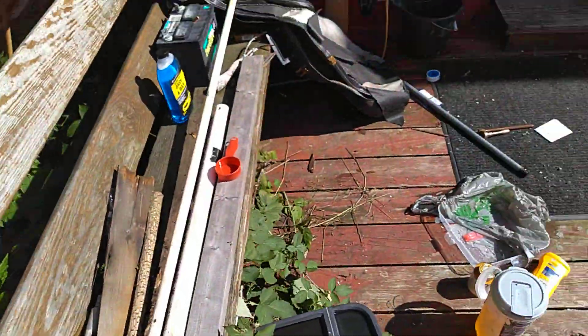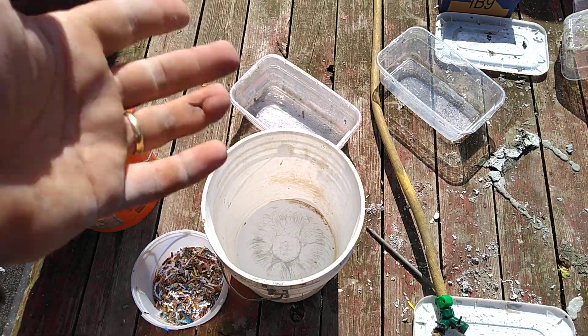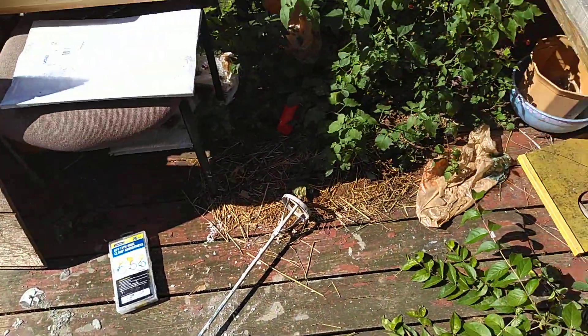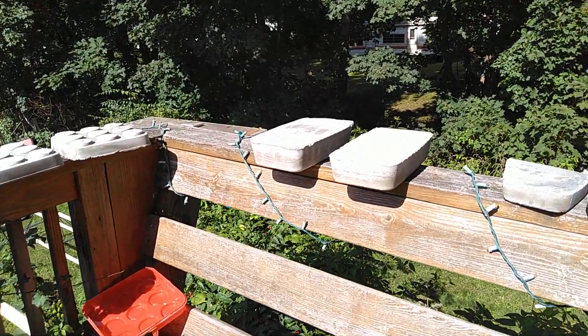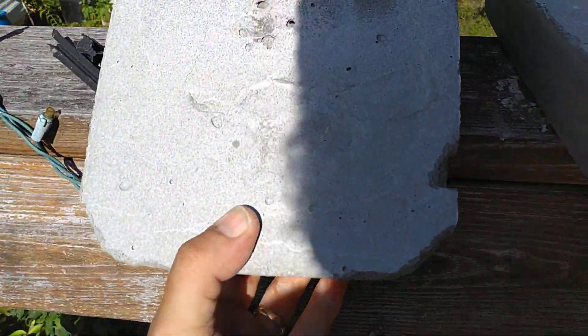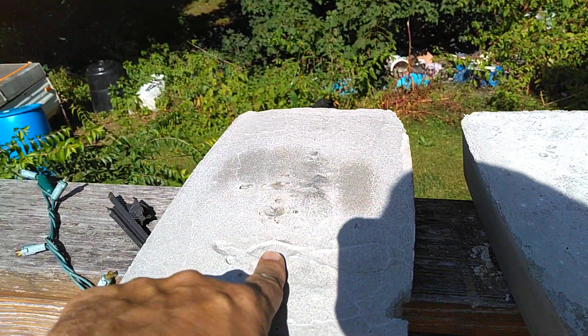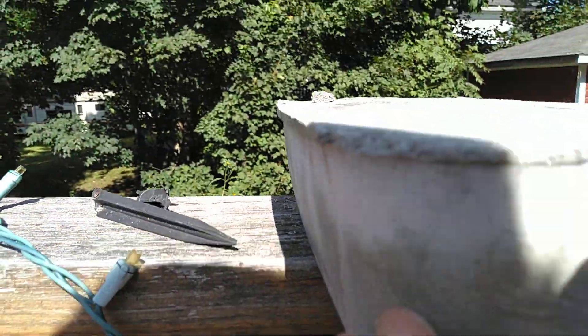What I do is take a mixture of Portland cement and water and make about a gallon of slurry. That slurry should be the same consistency as chocolate pudding — not thick like peanut butter. I haven't had any luck that way, but chocolate pudding consistency will get you this type of hardness and finish. This one you can see has tiny cracks everywhere. I moved the container while it was only hours old and the top had skinned — when I moved it, all those little cracks formed. But they can't really do anything structurally. It's kind of like pumice in a way.